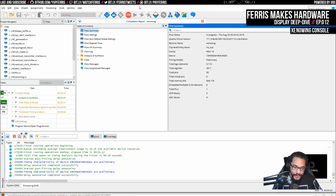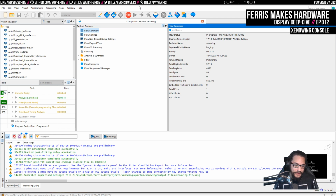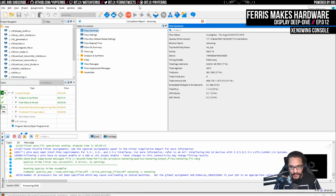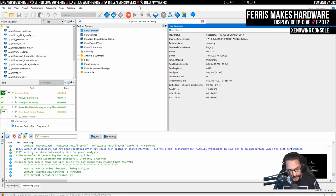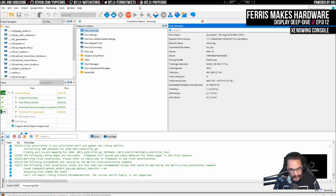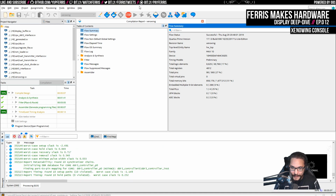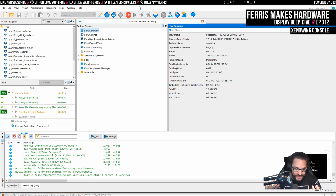Now, the thing is, I wouldn't be driving the SDRAM directly. There is a PHY layer underneath, which actually will issue the commands and figure out all of the timing. So then I would be issuing lower level commands to the memory, but it's still opening up a world of hurt in terms of potential errors, because I'd have to, for example, ensure that we're always doing refreshes. It's probably the biggest one, and then also need to figure out what the sequences of states are that we need to have for proper operation of DDR3, which is just something I've never looked into.